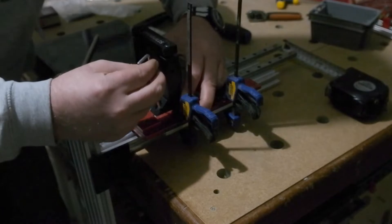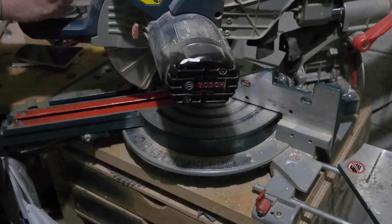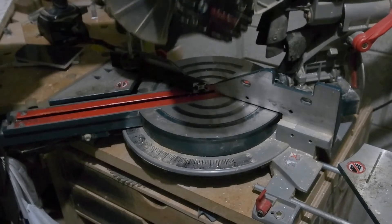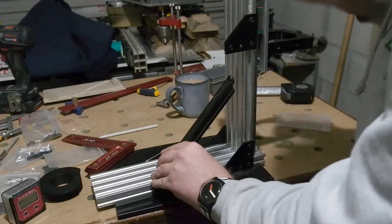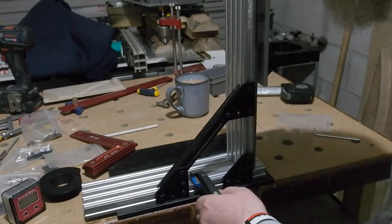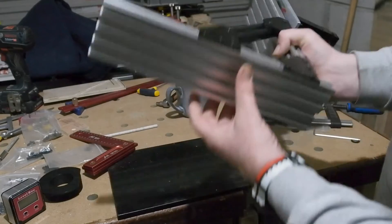To get in the ballpark I set the motor mount's flat sides to a square referenced off the plate. At the mitre saw, here's a piece of 2020 profile getting a 45-degree mitre on each end - this will form a diagonal brace to keep the drill stand rigid. Fixed in place with corner brackets and cinched down, it made the whole thing super rigid. When fixing the brackets to the base it's clamped to the flat granite, ensuring nothing protrudes from the bottom.